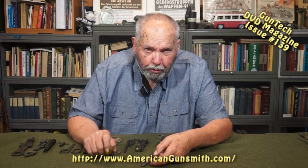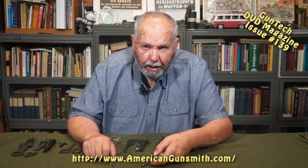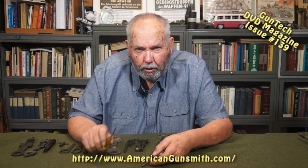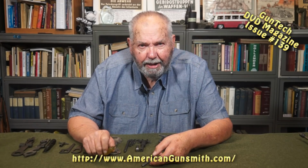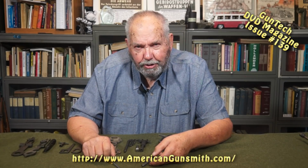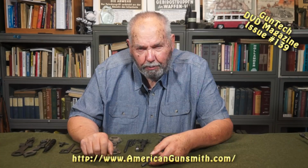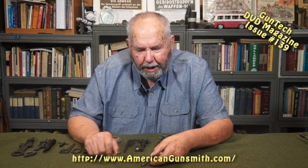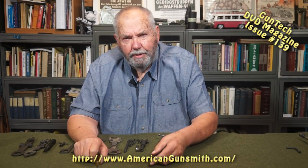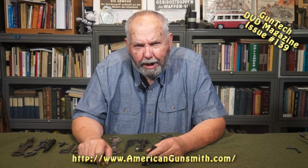Now, before the tool was developed, there was a World War II magazine called the Ordnance Sergeant, which published all kinds of articles on how to take care of stuff, how to do this, how to tighten your tracks. They were the ones who said you take fired cases from a carbine, you can use one case to do the firing pin, and two cases to remove the extractor and firing pin.